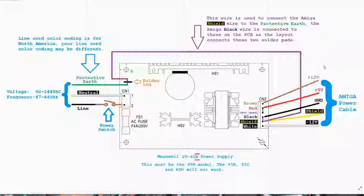Based on the color codes I found in my cable, this is where they were attached: the plus 12 is to this first pin here, plus five is to this pin, the black ground is to this pin, and the shield is to this pin. On the printed circuit board itself, these two solder holes are connected together and these two solder holes are connected together. By hooking the ground from the cable to this point and the shield wire to this point, they're electrically tied together.